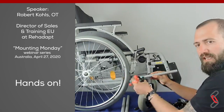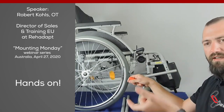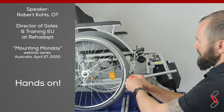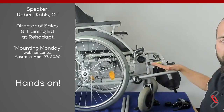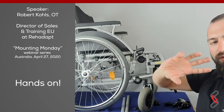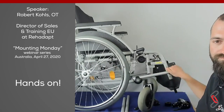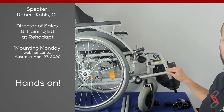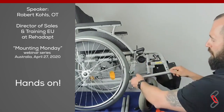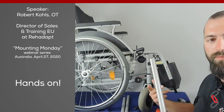The clamping force is higher when we are closing the bolts with a right-side rotation. And also the weight of the communication device afterwards will move the mount upwards, and that will also create a right-turning movement on the mechanical components. So now the first tube is installed, and when we open the base coupler, we can remove that first tube very easily, and later also all other components.